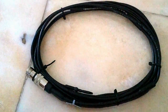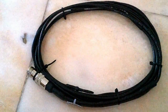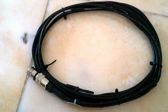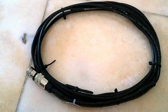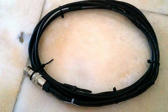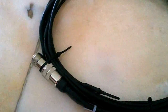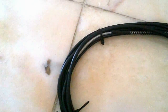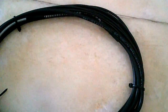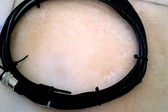This was a special version made when I asked Willy if he could make one for the UK channels, and it's a little bit longer. It's around 7 meters in length, where the other one is just under 5.5 to 6 meters. So if you're going to order an antenna from Lambda Halber, ask him for the UK version, like he made for me, because otherwise you could end up with an antenna which is too short for doing the UK40, 27.6 to 27.9.